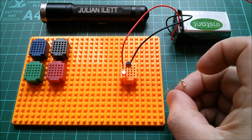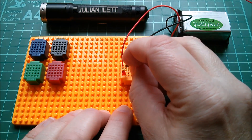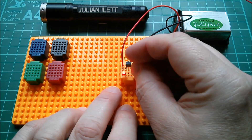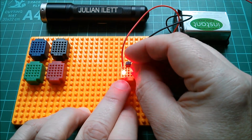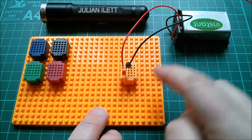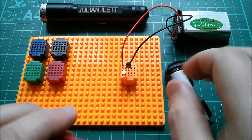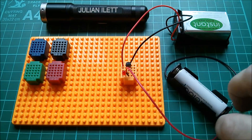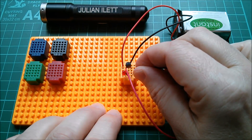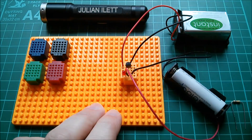I can probably do it with the 100k resistor — if I take the gate more positive and hold it there, we get a really bright LED. I fixed the camera's exposure for this video because I didn't want it responding to the change in light level. If I take the gate more negative — and the only way I can take it more negative than the negative of this battery is to introduce another battery — I take the gate more negative, wait for it to turn on, then I can pinch off that channel and tell the transistor: don't conduct at all.